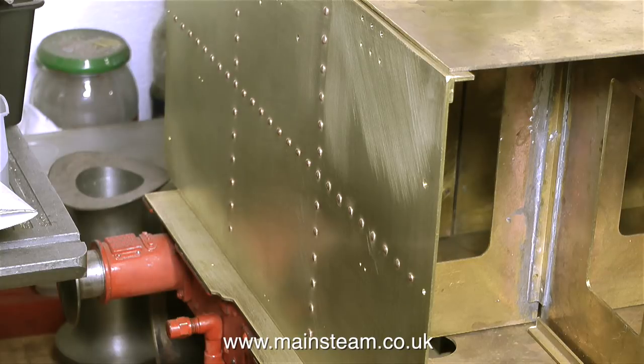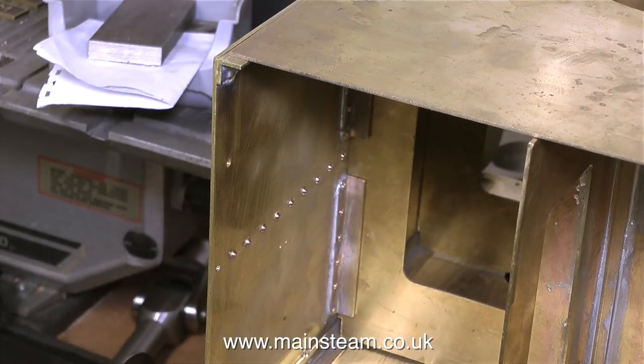This is an example of John's riveting skills. Following closely the full-size design, these rivets are much flatter than normal on the outside. But on the inside of the tender — the part that no one ever sees — the rivets are a different shape entirely. John's used a standard rivet snap to form the heads on the inside of the tank. If I'd have been doing this job, I would have just flattened over the heads inside the tank, but this is what separates people like me and people like John. This is perfection.